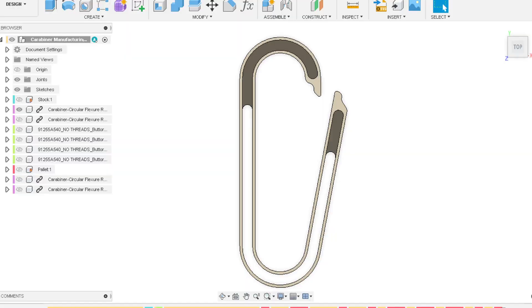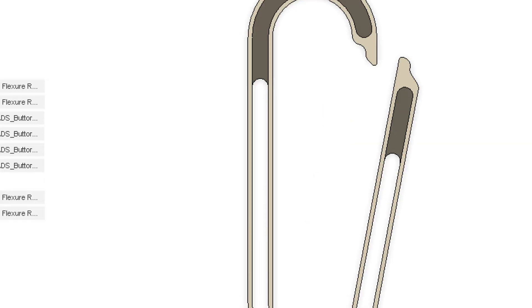Our titanium right here finally just showed up. I have a design I'm happy with. The biggest problem was the width of that slot — before, it was too small, and I didn't have a tool that was both long enough and small enough to go all the way through. So I redesigned the carabiner to use a larger tool in that slot — in this case, a 1/8 inch end mill, which is actually pretty large for a lot of what I do. My biggest worry is that when I'm machining these, these long skinny walls are going to get floppy and I'll get a lot of vibration on the tools. The next step is figuring out how I'm going to machine these things and, more importantly, how I'm going to hold them on the mill.